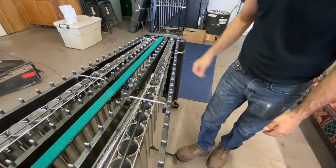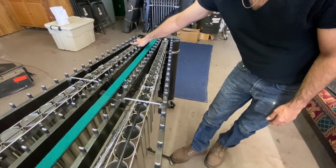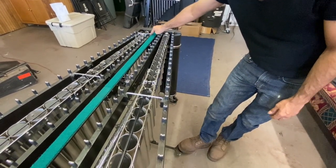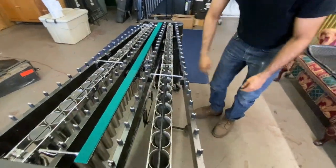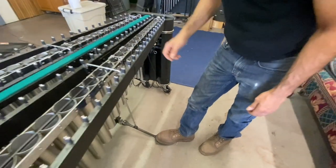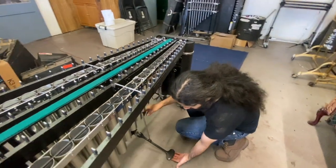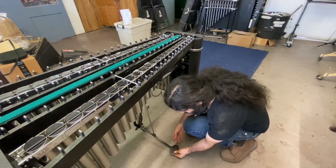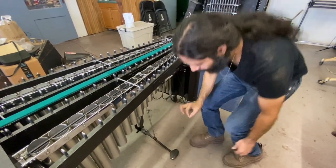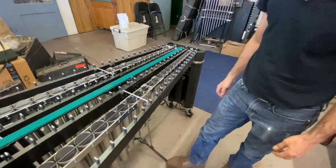You don't want it to come down too much though, because if you do, you're going to start lifting up on this rail here. It'll actually touch rail number 3. So these arms should never touch rail number 3. You'll lower it just a little bit. The best way to do it is to operate it so that the clutch is on and you're able to get your fingers underneath and it'll just rest on your fingers. Tighten on there, and now you have just enough room to release that brake. And that is the exact amount that you want to be able to operate the pedal.